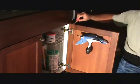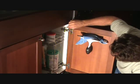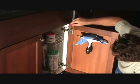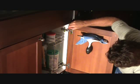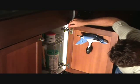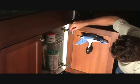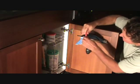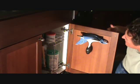I wanted to show you these screws again because we did have to do something else too. Here's the top screw and the bottom screw that we undid — that gave us a little room since the door was so high up and I needed to slide it down. It was still rubbing slightly, so there is another adjustment screw — this front one, not the back one. That pushes the hinge in and out, moving the door a little bit. By playing with that one and the one at the bottom, you can push one in and pull one out, and sometimes that moves your door just a little bit. We actually used two different adjustments on the door.